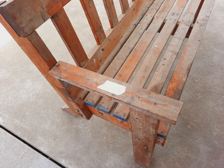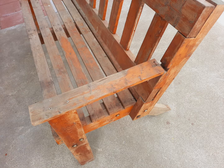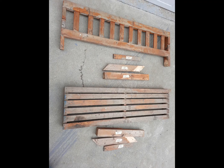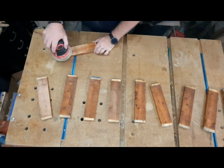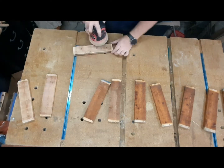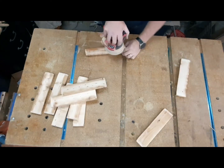This whole video goes over how I do that. I started by taking it apart, which didn't take too much to get those armrests off. And bam, it's all apart — well, mostly. Now everybody's favorite thing: sanding. I took 80 grit to this to knock off as much of the polyurethane as I could.